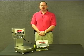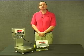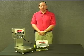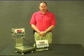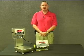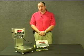The first highlighted connector is the load cell connection — that's where your load cell would be connected. The second connector is one of the COM ports. There are two COM ports standard on this unit: that's the RS232 full duplex port. The next one highlighted is RS232 or 20 milliamp.